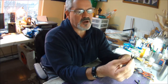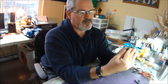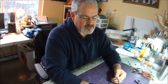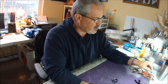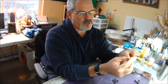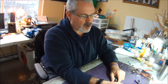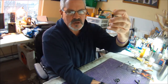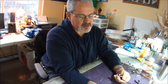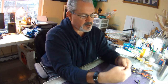The other thing that doesn't come with these motors is the bullet connectors. These are just 3.5mm bullet connectors. I've got lots of those around — normally you put the female ones on your speed controller. Most park jet motors come with connectors already on, but for these quad racing motors, obviously they don't. So don't ever throw any of those away — you'll need to solder your own on.